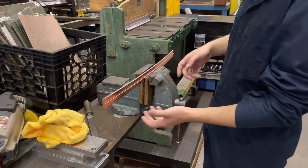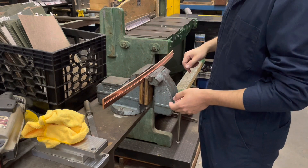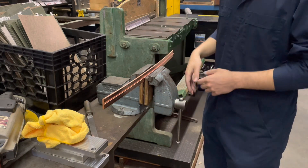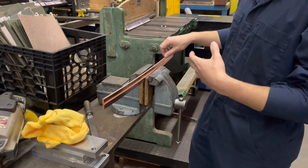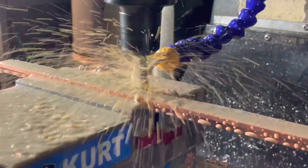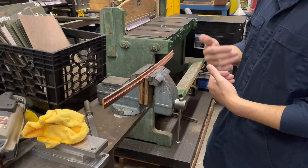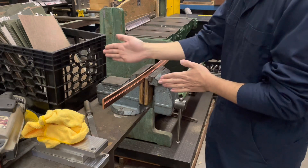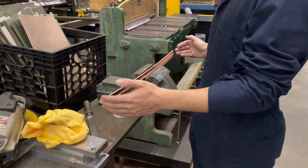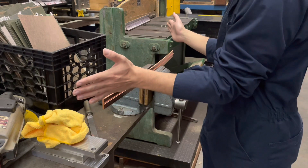As you can probably see on the camera, this piece that we've just pulled off of the mill is significantly bowed, and it's not supposed to be like that — it was straight when it was put into the vise. The soft nature of the material allows the milling cutter to push material back down into the surface that it's milling off of. This causes an uneven distribution of tension in the z-axis along the bar. In layman's terms, there's more material on top than there is on the bottom, and that causes it to stretch and deform this way.